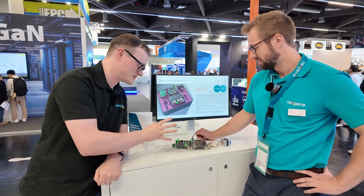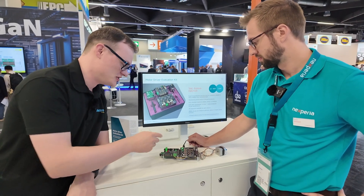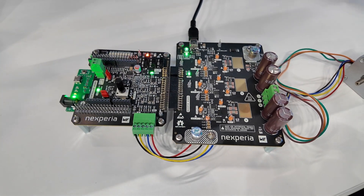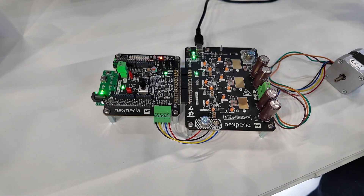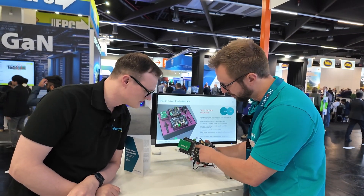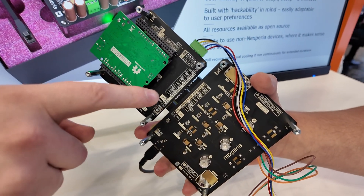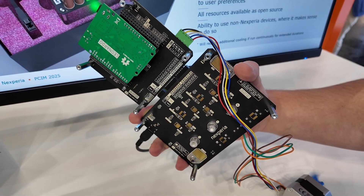This design is really nice — if you want to make changes, you've got so much space so your soldering iron doesn't knock something else off or cause tombstoning. We've also worked to avoid tombstoning in general — we can't guarantee it of course, but if you are swapping out resistors or capacitors, tombstoning shouldn't really be happening. It is also quite heavily documented everywhere on the silkscreen, so you shouldn't need to jump into the user manual at all times, and you won't confuse ground with high-voltage power when you flip the board.